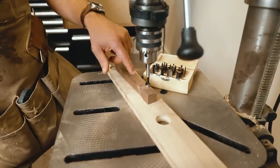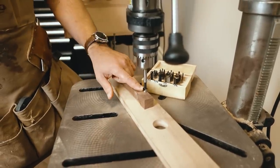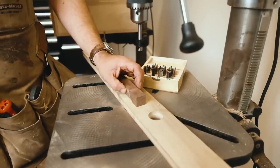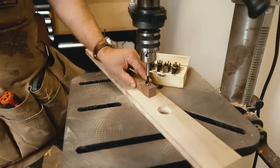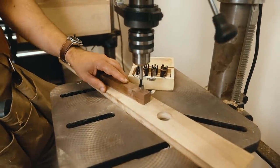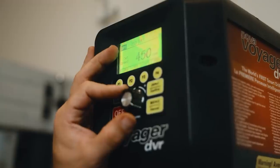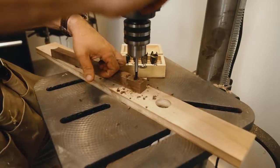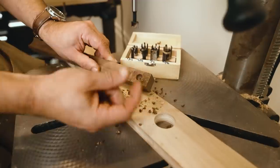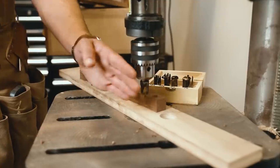One of my favorite uses for Forstner bits is making plugs for holes. Because these have a flat bottom and are perfectly sized, you can easily use a plug to hide a screw. You always want to use your Forstner bit first — locate where your hole is going to be, use the spur to find the center punch, and hold your hand loosely so it finds the hole. I have this set to 500 RPMs for a half-inch bit into hardwood. Always do your Forstner bit first, then use a drill bit sized for your screw to drill all the way through and shoot your screw. Cut your plugs from a scrap piece of the same board and make sure to line up the grain when you put the plug in.